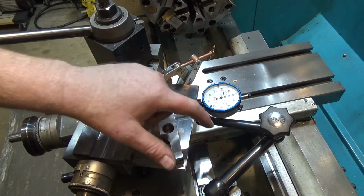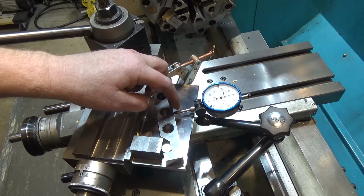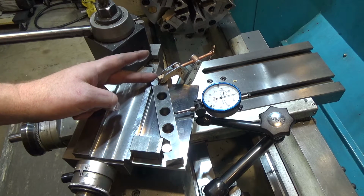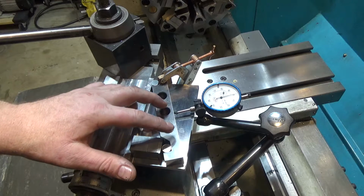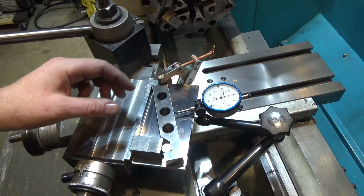Now, if I'd made the platform bigger, I could do larger angles, but then you have to have a longer throw indicator. I really need a 2-inch throw indicator dial to do a good job on this. It'd also make it easier because I could set my zero at the pivot point of the whole compound, which would make everything great. Because right now I'm iterating, much like the nod on a mill. You have to set this a very similar way.